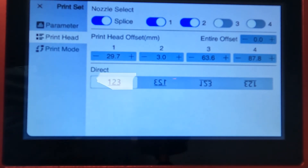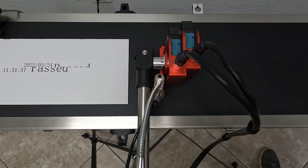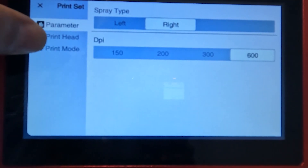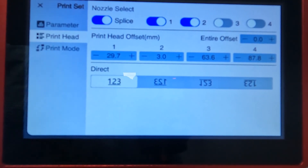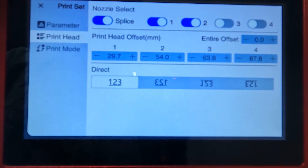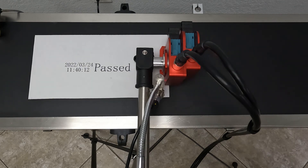I'm going to run my first sample through. You can see from the video that my bottom and top print heads don't line up. The next thing I'm going to do is measure the distance between the bottom and top print head in millimeters. I'll go back to the print head settings — I see from the measurement that I'm about 49 millimeters, so I'm going to add that here. Let's call this 54. Now I'll run the next sample and you'll see that the prints are lined up nearly perfectly. We'll just make a couple of minor tweaks.